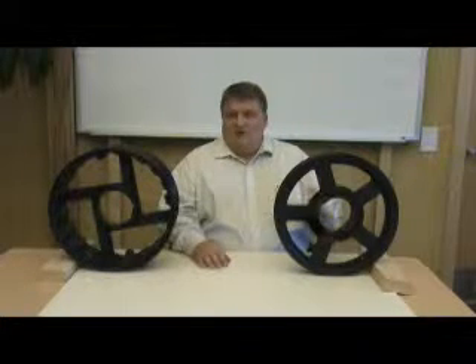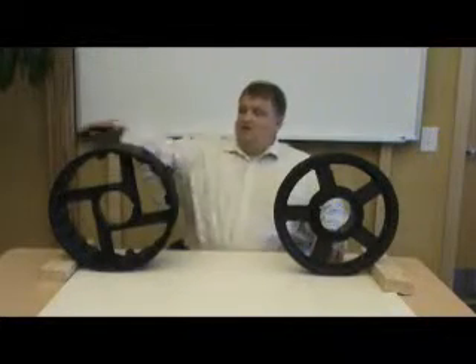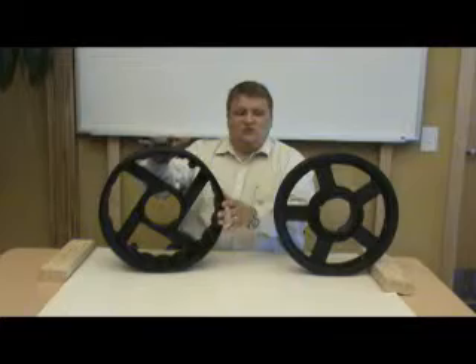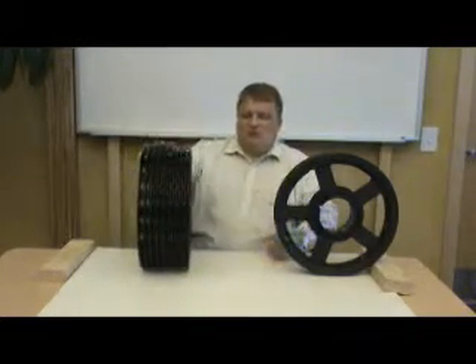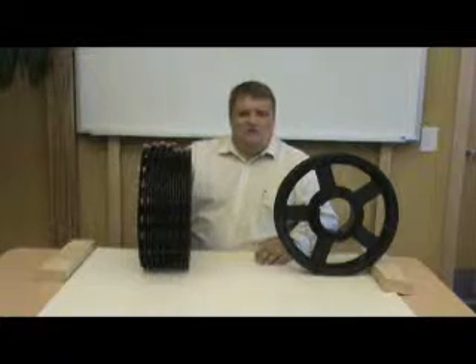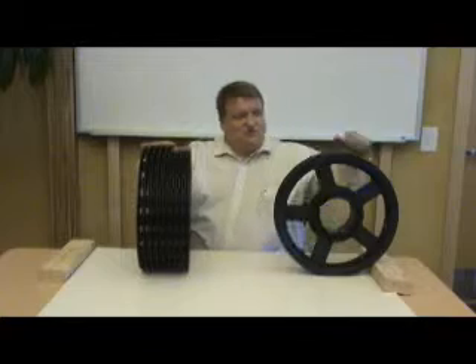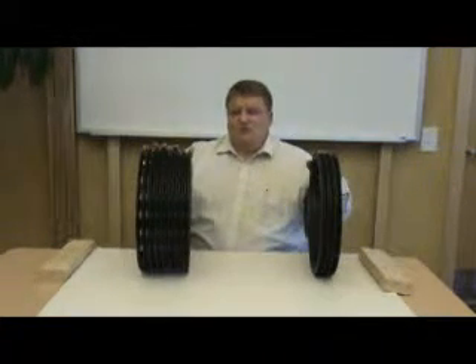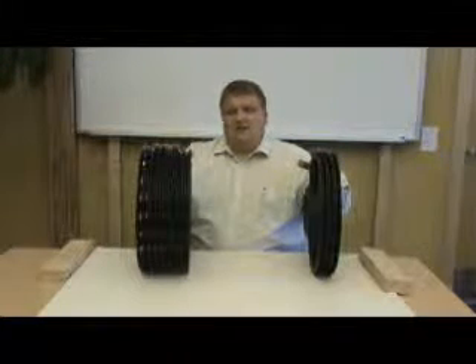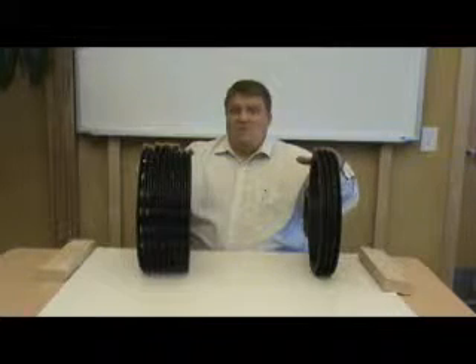Also, what's very limiting is the speed of gray cast iron, and that is where we have been using these special pulleys. I'll just show you the profile of one of these. Here's one of our specially vetted VTP pulleys that we're using on our blower and compressor drives, and you can probably see how many more grooves we have on this one. This is an 8-groove versus a 3-groove design belt drive, and believe it or not, both of them have the same mass.